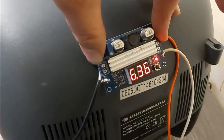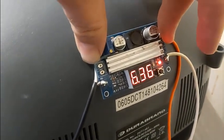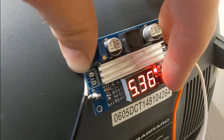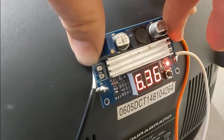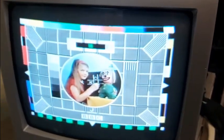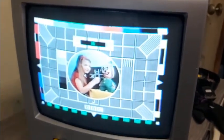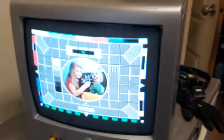Just to add a little bit to the end of this: I've had to add a DC-to-DC boost converter because the voltage going into the heaters was only 5.36 volts. I've stepped the voltage up to 6.36 volts and the picture quality is much much better - the brightness is pretty much perfect. I'm not entirely sure if it's a fault of the TV or how it was designed, but there's been some cathode poisoning to the cathode ray tube.